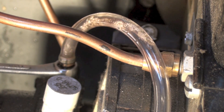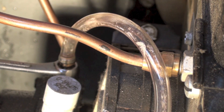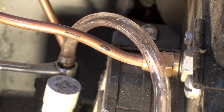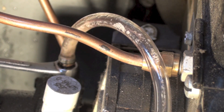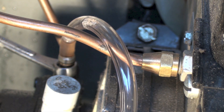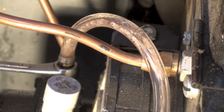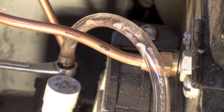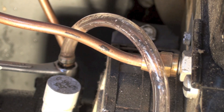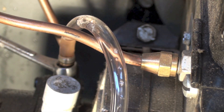In this case, all we're doing is pumping air — you can see that air pumping through there. That is a vacuum leak in the line. Sometimes the burner will run for a little while and then it'll shut off and do all sorts of things like that. This can also be an empty oil tank, where it'll bring a little bit of oil but mostly air through, and the burner will start and stop.